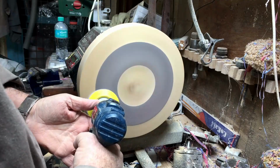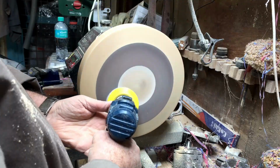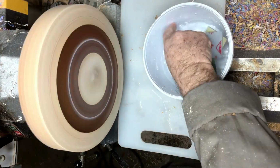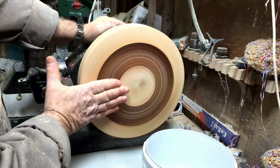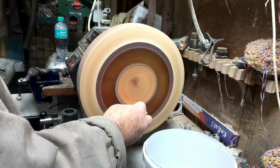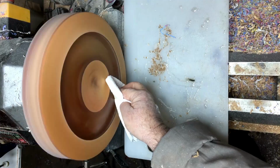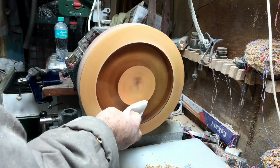At this stage, what I'm doing now is I'm just sandpapering it all the way to 600, and then I'll be able to see. And now I'm using wet sanding pads just to see how it looks inside all the way to the wood. And I think you can see already the wood, and it came out quite clear. Novus 3.2, heavy scratches and thin scratches.